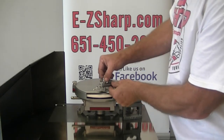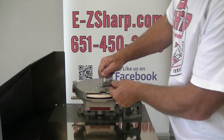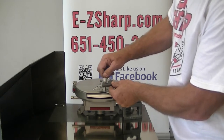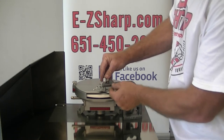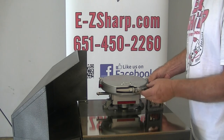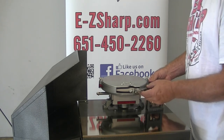It is really important to do that. You don't want to wear one particular spot out on the dressing tool. So each and every time you dress the wheel, turn that dressing tool. It'll prolong the life of the dressing tool and it'll also prolong the life and put a finer finish on the wheel.